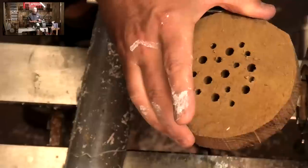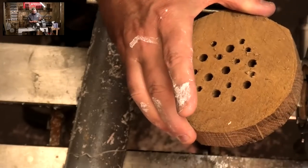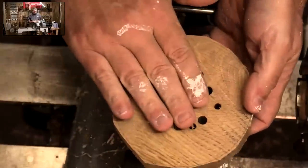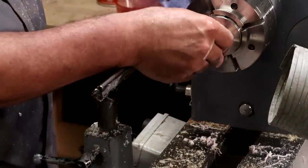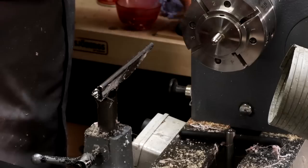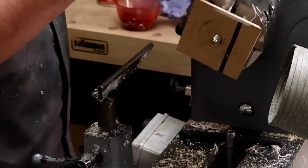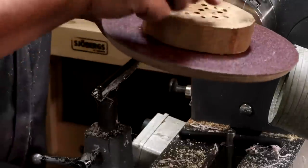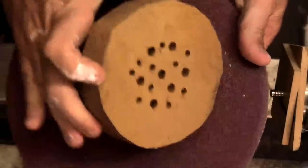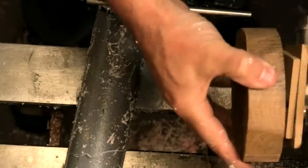We're going to do the reverse side first, creating a recess that I can expand a set of jaws into, then come to the top — it'll be easier after that. So I'm going to the flat face — the plain surface — and pop a screw chuck into that. I'll pack it out a little bit with a piece of MDF. This oak is really quite tough stuff, so we can get away with a fairly small grip. Let me just get rid of the burring where the drill bit comes through, otherwise it won't go flat on the screw chuck.